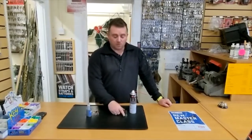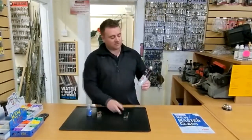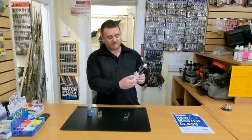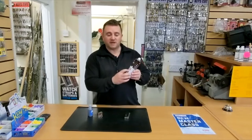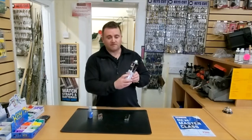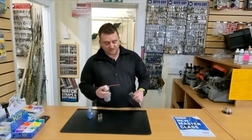There are two different means of maintaining cylinder locks. We use 3-in-1 oil. A lot of people say they use WD-40, but let's stay away from WD-40 because it doesn't have that key ingredient — PTFE — which coats all the components, lasts longer, and allows you to maintain the lock every six months rather than every month with WD-40. So if you're going to maintain your own locks, use a multi-purpose oil with PTFE in it.